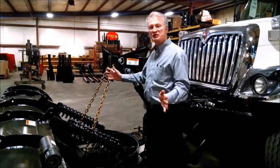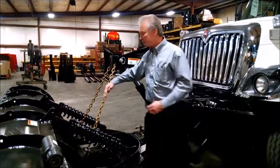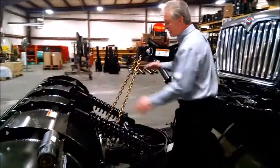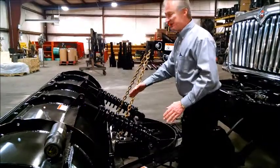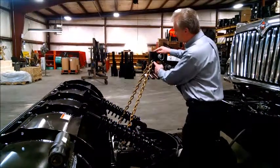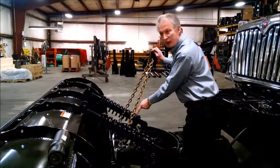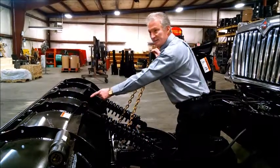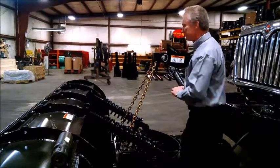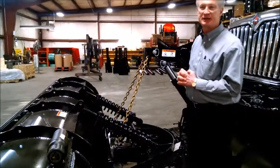As this plow is angled, when this lift arm sits behind your pivoting point and the pick point of your plow, the chain length needs to grow longer. Since we're creating more of a distance between the end of this arm, the pick point or the pivot point, and where the chain will now be located as this follows the arc as the plow angles — for example, to the right. Ken, our sales engineer, will start up the truck and we'll demonstrate this.